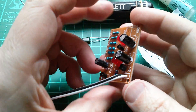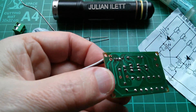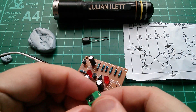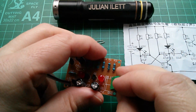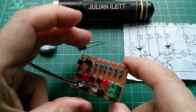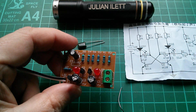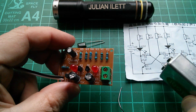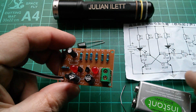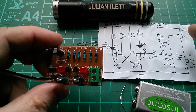I've fed these two wires through the two holes on the board so I just need to solder those on the back. Now let's solder in this terminal block which goes there — oh that's a very loose fit, that'll need some blue tack. Now that says six volts but I think I'm going to use nine volts on this. It shouldn't make too much difference; certainly there's nothing here that's going to have a problem with that additional voltage.